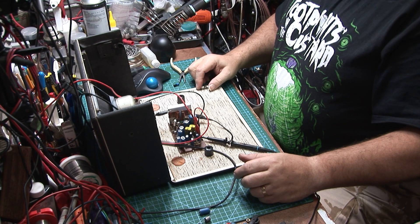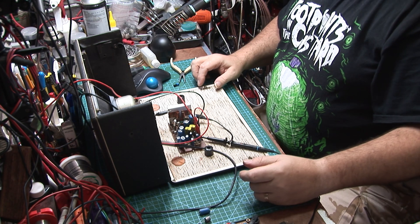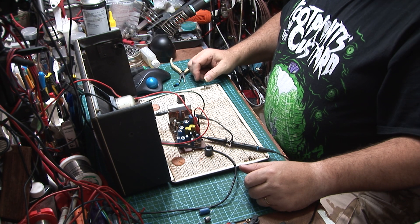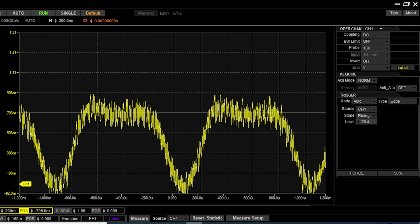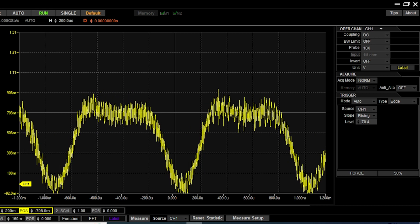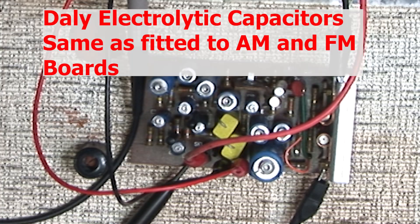Let's turn on the generator and see what it's doing. It sounds all well and good but that's certainly not very loud — that is not a watt of audio. It's working but it's not a watt, and if you look at the scope screen you'll see that the output is certainly not very pretty at all. It's very distorted, very non-linear.